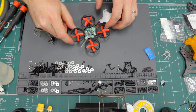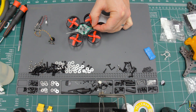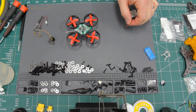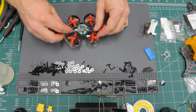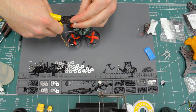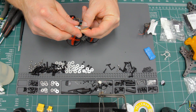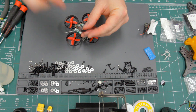First I have to remove the old camera by unsoldering the power wires that go to the camera and VTX. The power wires are soldered onto the contacts of the battery plug so they get power directly from the battery. You need to make sure that whatever camera and VTX you get is compatible with the battery — with most tiny whoops it's going to be a one-cell lithium battery at 3.7 volts. Because I'm soldering the power wires directly to the board, I need to cut off the old power connector, then strip the insulation off the power wires using an X-Acto knife, being careful not to cut too deep or you'll cut the conductive wire inside.